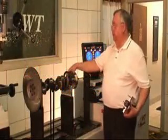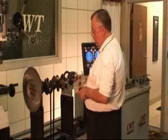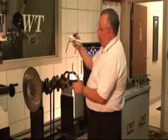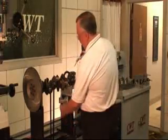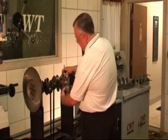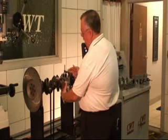We're going to go ahead and turn the crankshaft around. We've just grabbed any bob weight — don't care which — because they all weigh exactly the same. Notice that we're using hardened guide pins for the alignment. By bringing the crank pin to the front, I'm going to come across and let it line up. If you remember, I put the small attachment nuts here to the bottom.